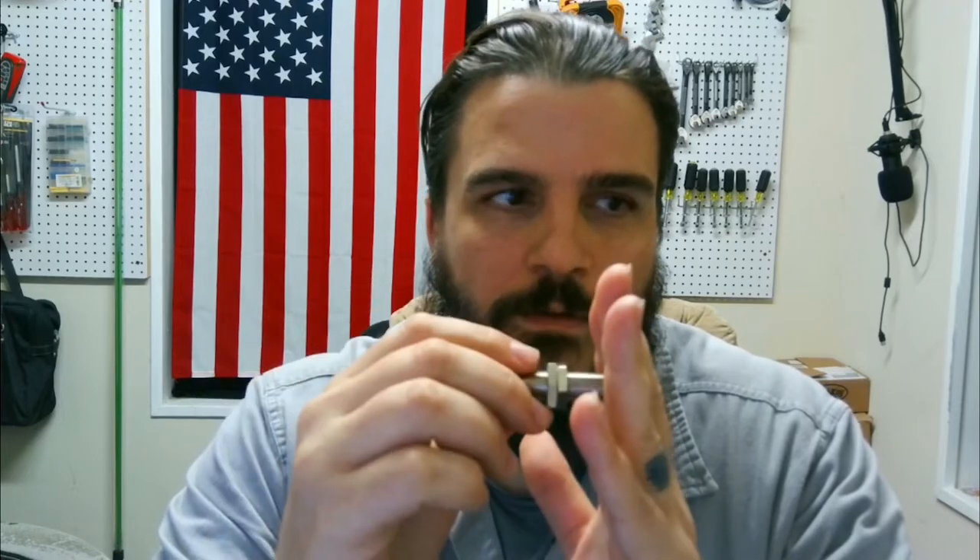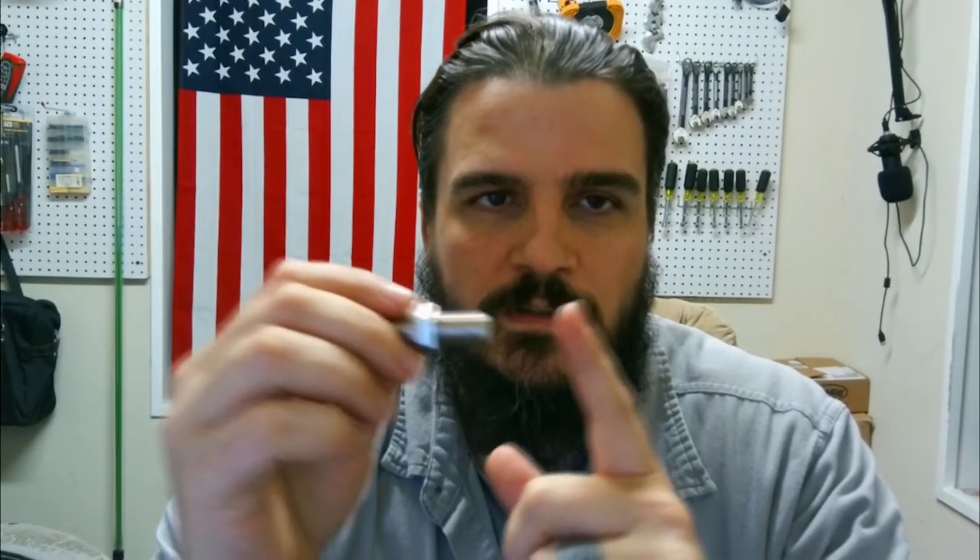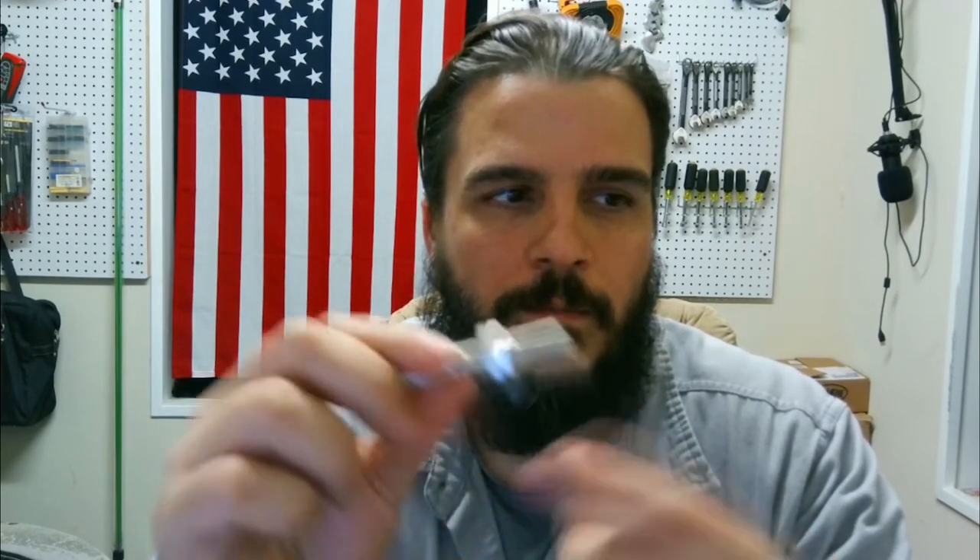I'll make this video pretty short and get straight to the point. Proximity sensor — what it does: there's different types, there's capacitive, magnetic, and several others, and what it does is it senses for material passing in front of it. They come with different throw distances, different sensing distances basically, and they come in different shapes and sizes.